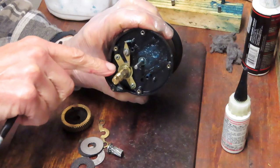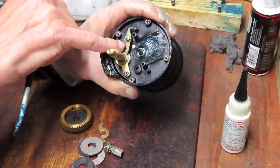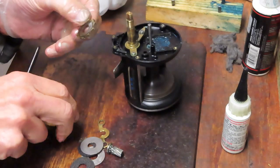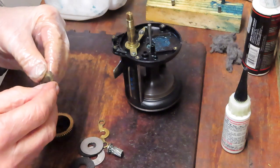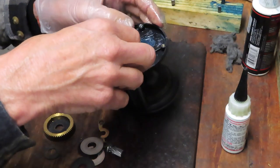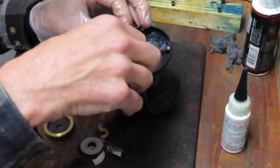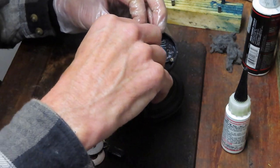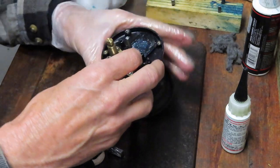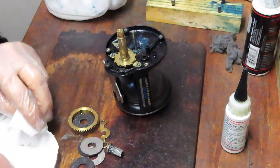We don't need to remove the clamp down which is holding in the shaft. This is not the bridge sleeve of the other Penns where you have to pull that off to lubricate the post, so you can just leave that as it is. You don't have to take off the anti-reverse dog — we'll show you how to reset that when we put this back in. This has got a rectangular or oval kind of look to it, so what you're going to do is put that on, pull your anti-reverse dog out of the way, and find the flat spots on this gear sleeve. I'm doing a dance because that gear sleeve keeps turning on me — there we go — and that's how you set your anti-reverse dog. Fairly straightforward, fairly easy.